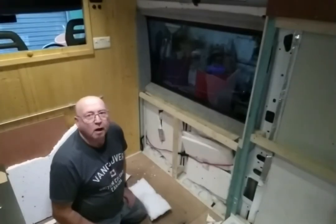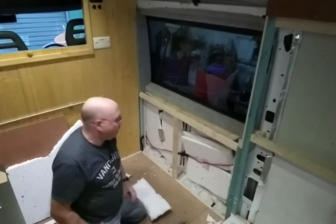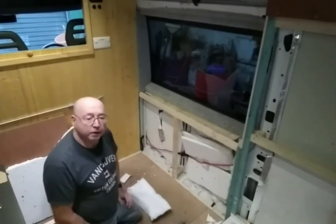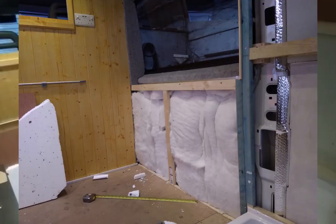Because it's such a large area to insulate, I'm bulking it out with the rigid board insulation I had left over. I'll put that in to bulk it out and then I'm going to put soft insulation over the top.